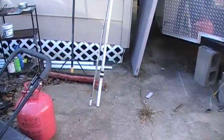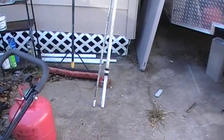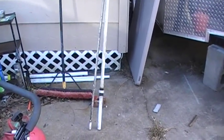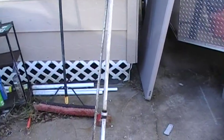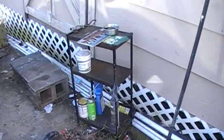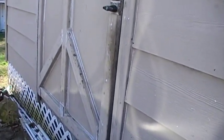It's a great antenna. So I wanted to point that out, that this is a broadbanded antenna, extremely broadbanded compared to the Tornado. So that's the only thing I'll miss about this antenna, but the workaround is get an antenna tuner. Okay, let's go inside and we're going to go ahead and take a look at the measurements on the analyzer and compare them to the paper.